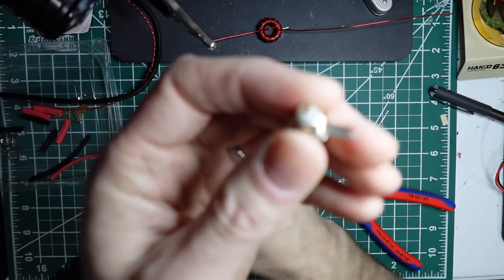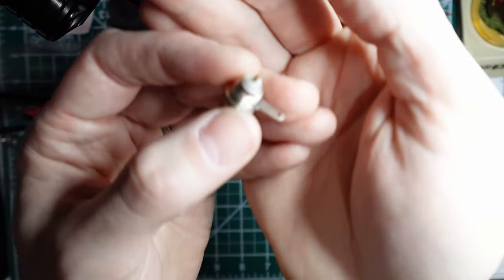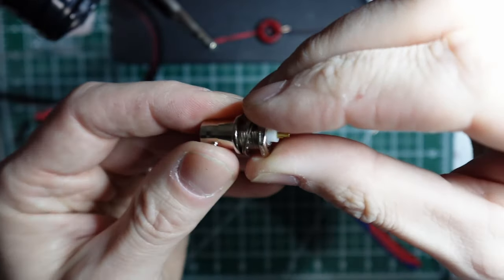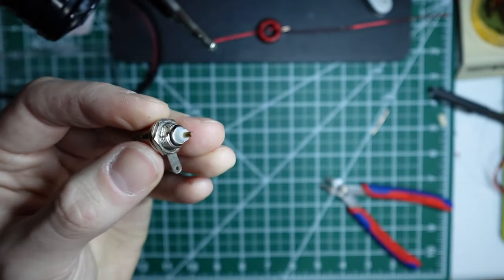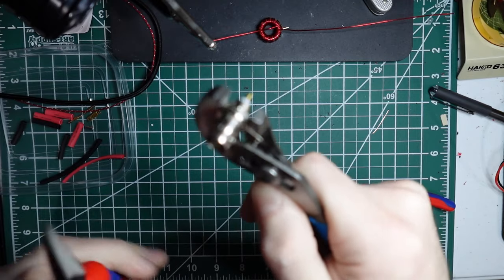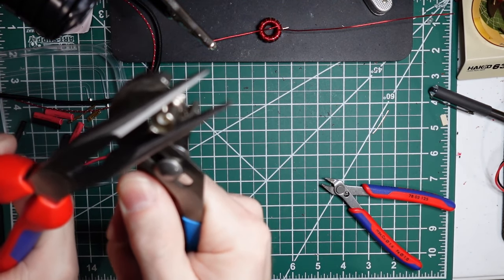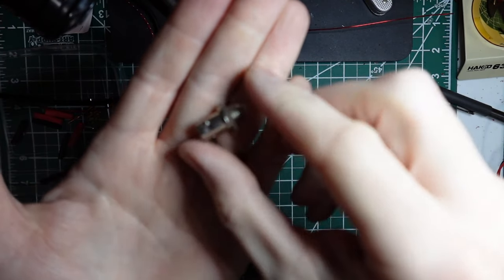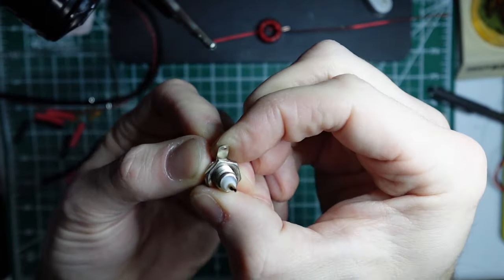Okay, so BNC connector, put your solder tab on it, as it's called. And our little washer and the nut. And I mean, you can do this many different ways. I grab it with a pair of channel locks and a pair of needle nose. Be real careful of the tabs on the BNC connector. It doesn't have to be overly tight, just snug it up. It's going to have some heat shrink tubing that's adhesive lined on it anyway, so. And then the tab gets folded up.